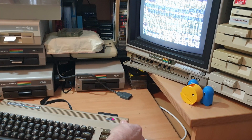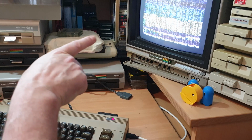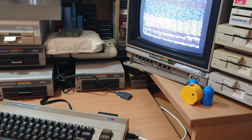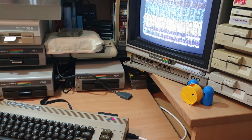We've got something going on, look. You see all the screen's changed. We've now got colours, different patterning on there. And press F4, F1, I think something changed, look. There's characters, something going on in there, clearly. You can see sprites bouncing about. So there's something happening there. At best guess, I would have said possibly PLA, U17. It could be character. And potentially the multiplexing chips down by the RAM. But we'll just try another one.